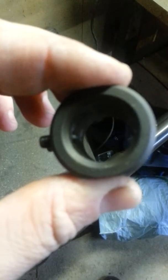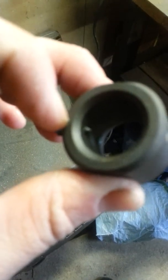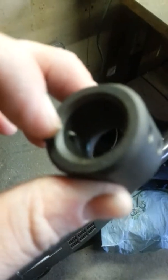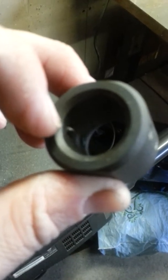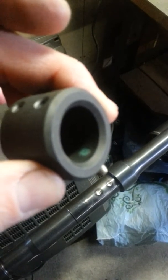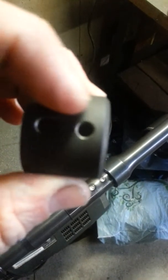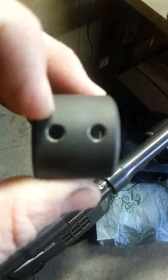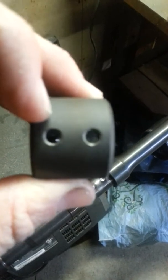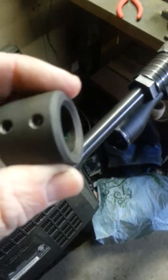Basically the way this thing works — the dimple portion for the gas port has a pointed screw on top that indexes on the gas port of the barrel, so it lines it up perfectly every time. The other side has a screw with a little rubber-backed head so it provides friction without marring up your barrel. Then these two holes are used to actually put the drill bit in to dimple. It'd be better to use a drill press like I did, but you could do this with just a hand drill.